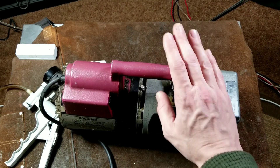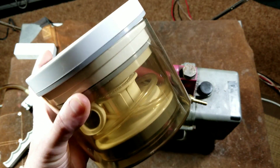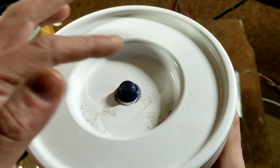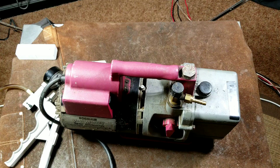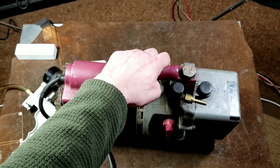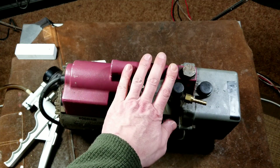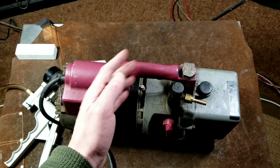It's a little difficult to use these with a vacuum sealer because those are integrated units, but they do sell things like this Black and Decker polycarbonate food vacuum storage container. It came with a special fitting if you want to try to vacuum mason jars, and a normal fitting — there's just a little one-way valve on the top of the lid. You put this fitting to a vacuum pump over this valve and it evacuates it. If you're ever using vacuum pumps for experiments — even making homemade light bulbs, rolling up a little piece of carbon — you need to evacuate the air so it doesn't burn up. Be careful though: most types of glass are not vacuum rated, and they can collapse like an explosion of glass. Make sure any container is rated for vacuum or it can explode and hurt you.